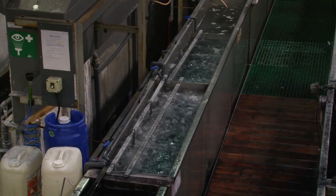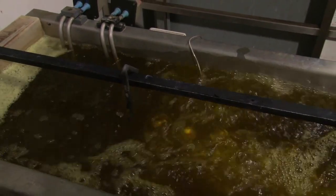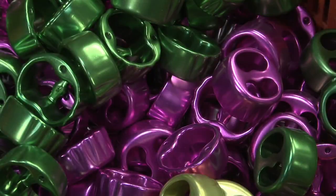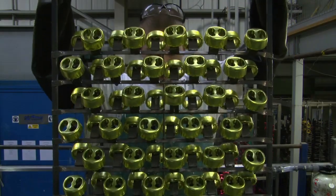Now we're ready for the dyeing process. The majority of our dyes are organic dyes. We immerse the components on the jig into the solution. Generally speaking, the longer the time in the solution, the deeper the colour they will go. After dyeing, components are rinsed again thoroughly to remove any excess dye. Then we're ready for the final part of the process: sealing. Sealing closes the pores, stops any bleaching out of the dye, and seals the film.